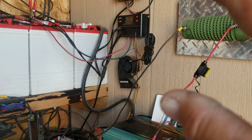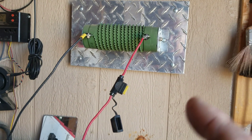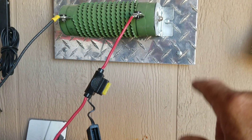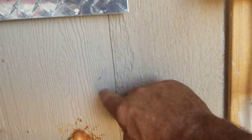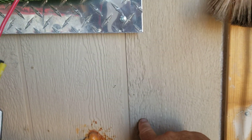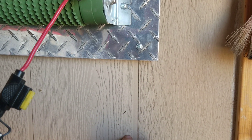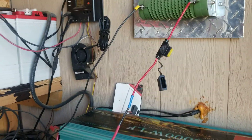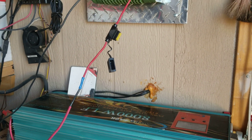Forget just tracking amps — remember the formula: P (power) equals E (volts) times I (amps). Picture a circle with a line through the center: big P at the top half, and I and E as two quarters on the bottom. So voltage times current equals power. If you've got 12 volts times 400 amps, you've got 4800 watts at 12 volts.